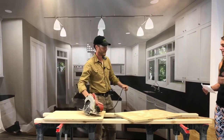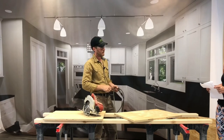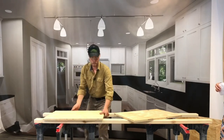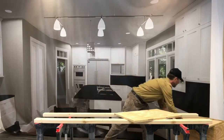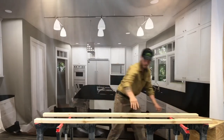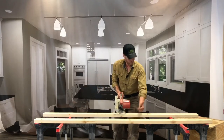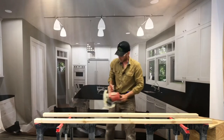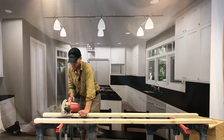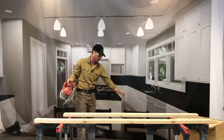We talked about setting up the cut, the saw safety, supporting the falling piece, positioning to best cut things safely, and establishing a temporary fence. Here's a quick example: this is exactly the wrong way to cut a two-by-four. If I'm going to let the fall cut, I want to cut over here on the right, set my depth where I want it, and just let the board fall. That's the best expert advice you can get about using the skill saw.